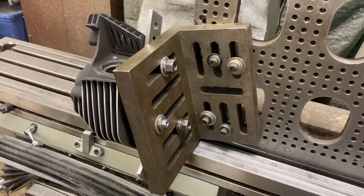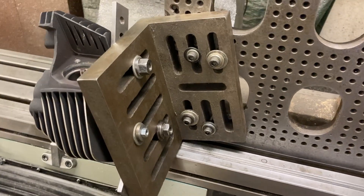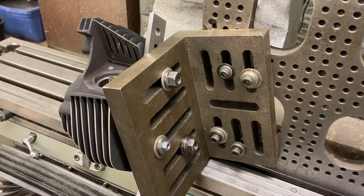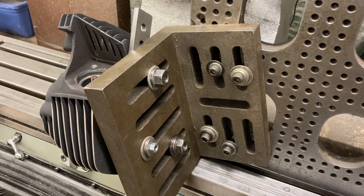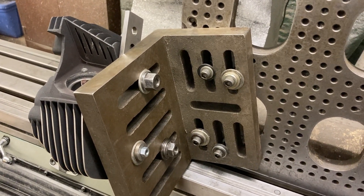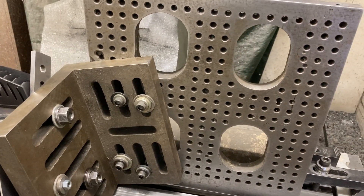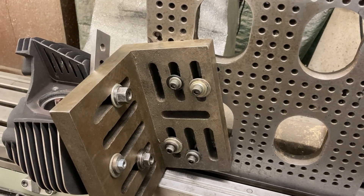So then I took this knee angle plate, turned it sideways. Being that it's got slots, it has a wide range of versatility and allows for a lot of options for locating the holes to screw it tight — and being that the angle knee has a whole bunch of options as well, this worked out nicely.